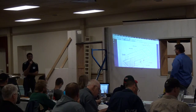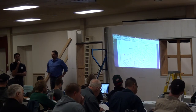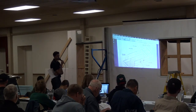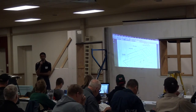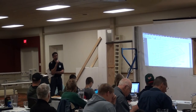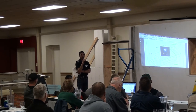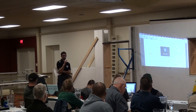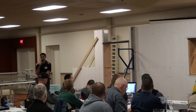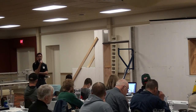On concrete slump: if you're not an experienced concrete person, tell your concrete company you'd like the concrete brought out at about a five slump — it's going to come out at about a six to seven most likely, almost always. Concrete truck drivers usually add water on the way to the site, so the concrete almost always ends up wetter than you wanted. Request a little stiffer and you can always add water when it gets there. If you're using different additives, you already know concrete well and just need tips on being more careful with ICF versus traditional forms.